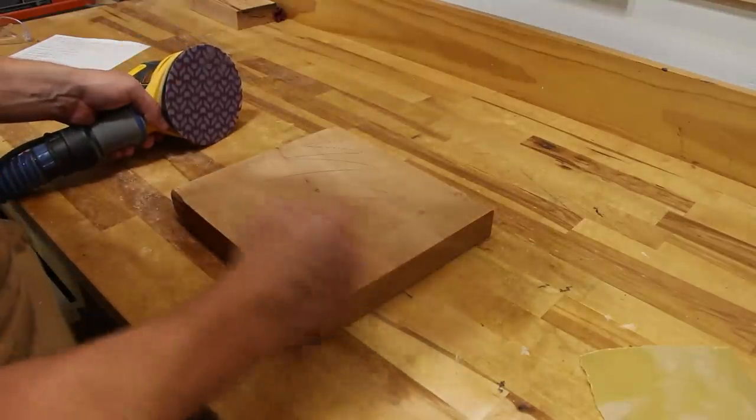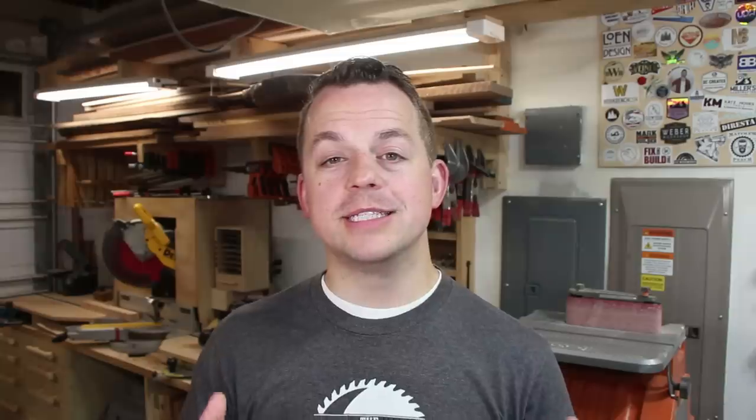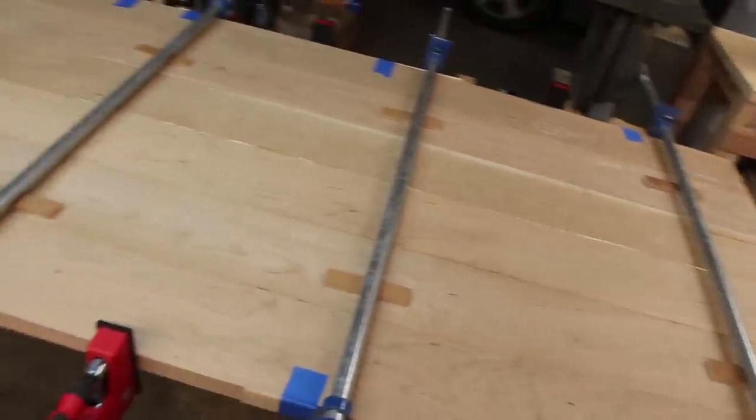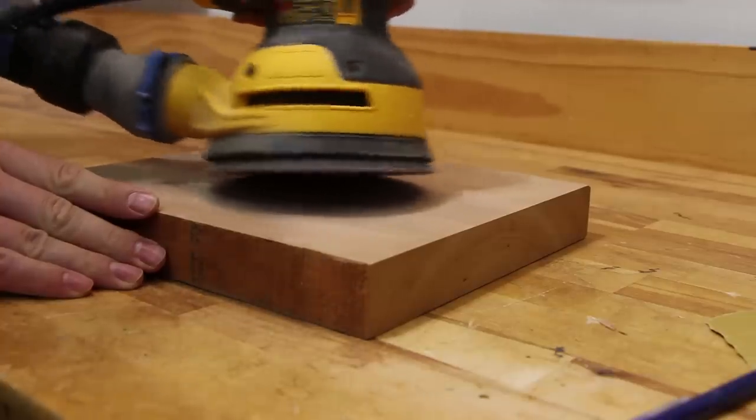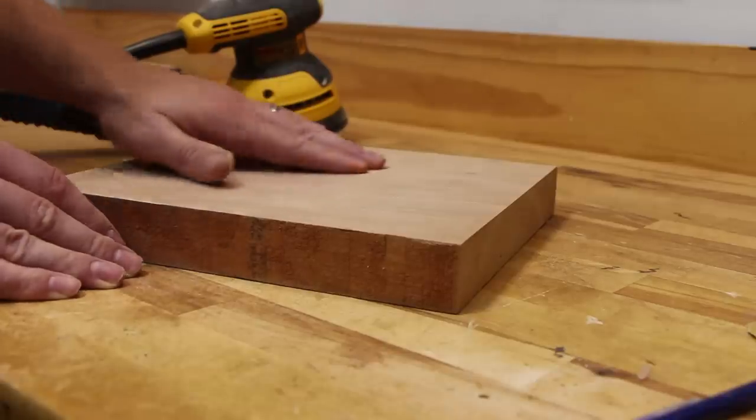Always make sure to sand with the grain even in a tight spot — the minute you start sanding across the grain those ridges will be very visible. Also make sure you sand evenly and consistently. You can do this by drawing with a pencil across the piece you're sanding, sand off all those pencil marks, then do the next grit, draw across with the pencil again, and sand off those marks — that way you get consistent even coverage. Sometimes there's temptation to tilt your sander just a little bit to dig in and work one spot. The problem is that creates little divots and dips that you'll feel on any visible or touched surface, so try to sand as evenly and smoothly as possible and don't dig in unless you absolutely have to.